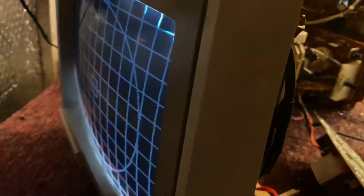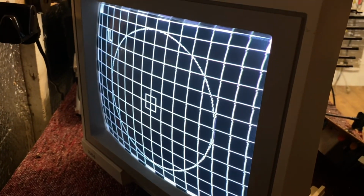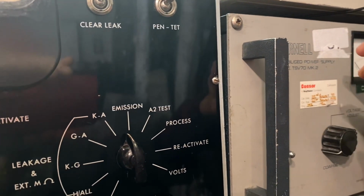I'll have to turn the 25 frames per second on, and I think we'll be able to take a better look. Here we are then, 25 frames per second, and we've got crosshatch up on there. Now if we just go over to my very fancy pattern generator, let's do the usual grayscale, colour bar and multi-burst. How well equal the picture is, and I think that looks pretty good, to be honest. Now I have tested RGB off camera, pretty good to be fair. Focus is pretty good. I've been adjusting this picture just now.